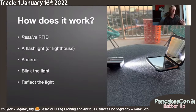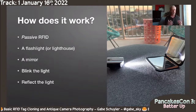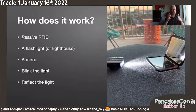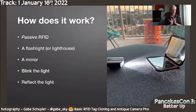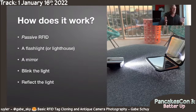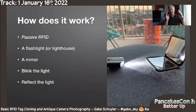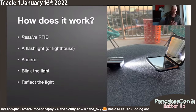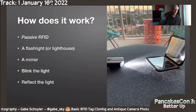With passive RFID, your tag or card or key fob doesn't have a power source of its own. The comparison people make is to a flashlight or a lighthouse — something that pulses at a normal rate but could also spell out a message in Morse code or binary. If I wanted to talk to you and I've got a flashlight but you don't, I could blink my light and send a binary message. Then if I send an even pulse, you could use a mirror to reflect or not reflect that pulse selectively, and actually send a message back. That's the idea: the reader has the blinking light, and the card can borrow that energy to send a message back.